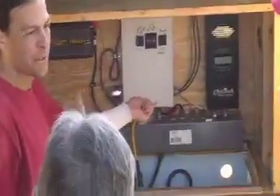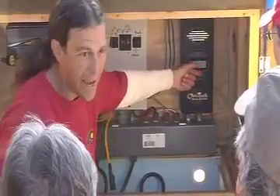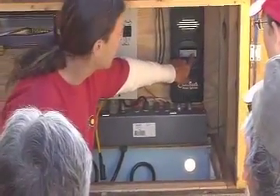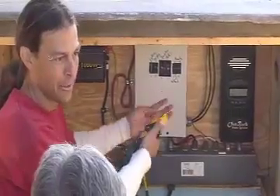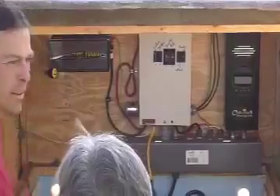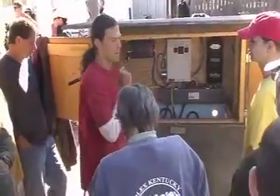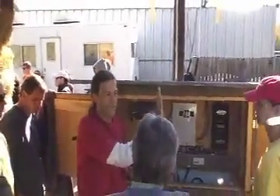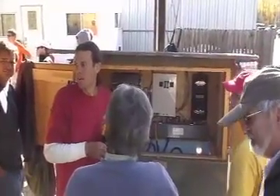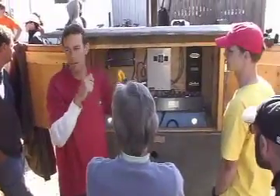When I came up here first thing this morning, we were absorption charging the batteries at about 14.5 volts, and I saw about 0.8 amps coming in and about 3.5 amps going out to the battery. The batteries are basically at a full state of charge and there are no loads on. The electrons not being used are just trapped internally in the modules — the charge controller is limiting them, only allowing a small stream through to the battery. Solar panels are current-limited devices, so they can handle that without being harmed.